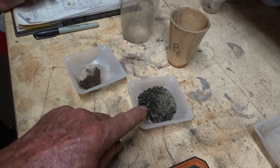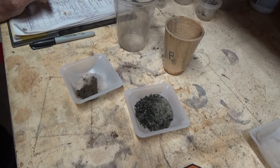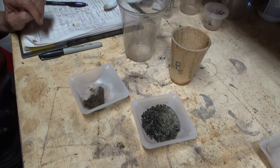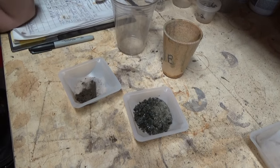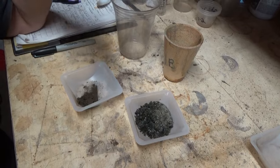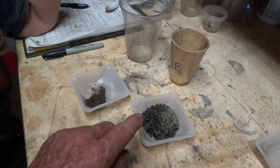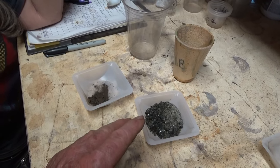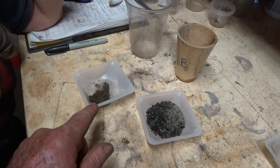Are you confident that this slag is able to absorb enough impurities to take care of that? Yes, and I am also adding a small amount of the standard constituent silica, soda ash, and borax as a little addenda to pick that up. So we'll have a full charge of used slag, a little bit of fresh slag, a fair amount of fresh litharge, some more charcoal to reduce the litharge, and this debris.